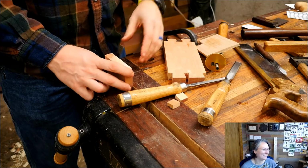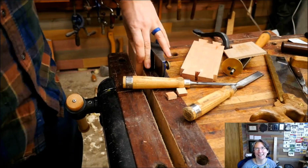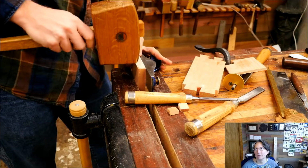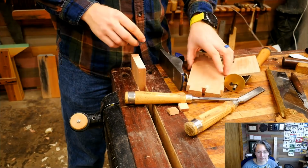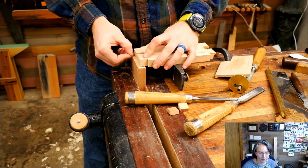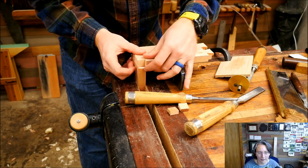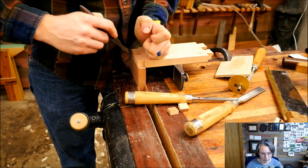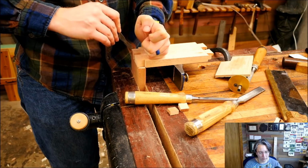So, let me move this over here and show you this angle. What I like to do is put it up against a block plane here, pinch it in there. That way make sure the top of the block plane is precisely the same as the top of the board. Nice smooth feel there. Now we can slide this back and I can put it on here. Now if we had half-blind dovetails, I would back this off so that there'd be that thickness of the reveal. But in this case, I actually want to draw those tails all the way across. So I'm going to line this up with those corners, make sure everything is exactly what it wants to be. And then I want to transfer the lines from these tails down to the pins board. Just like that. And so now I have these lines on here.